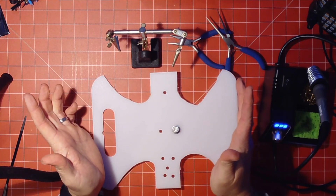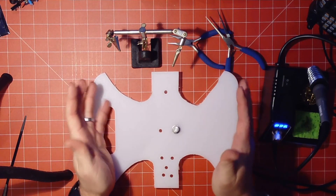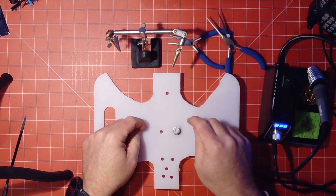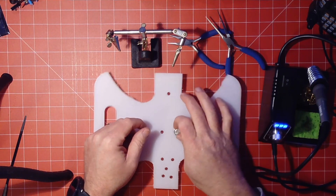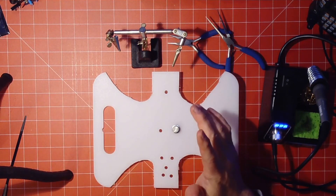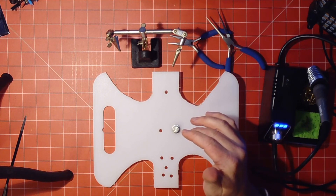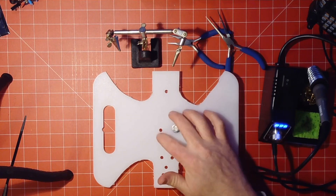You can actually do this entire project with speaker wire. You've got less than a buck in your center insulator, a few bucks for some speaker wire going out to each side, maybe a dollar in hardware altogether, and zip ties which most of us already have — or you can pick those up at the dollar store. For end insulators, you can use a piece of PVC pipe with a couple holes drilled in it, or pretty much anything that's an insulator.